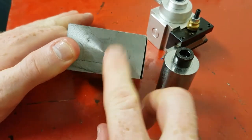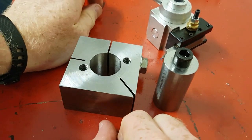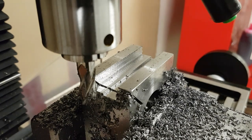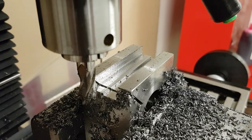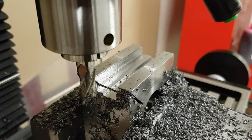I'm pretty sure it'll work because it already goes redonkulously tight on there — you cannot move it. I'm barely even turning that bolt and she goes tight as buggery, so I reckon she'll work. From here I'm going to show you guys milling that slot — probably chattering and doing all kinds of fun stuff when I hit that slit. After that we'll stick her in the lathe and show you she actually does work. This is the very last milling pass and I've had about as much fun as a nun in a brothel. I can only take 1.5mm cuts on mild steel before she really hates life, but for what I paid, this little mill is doing its job.